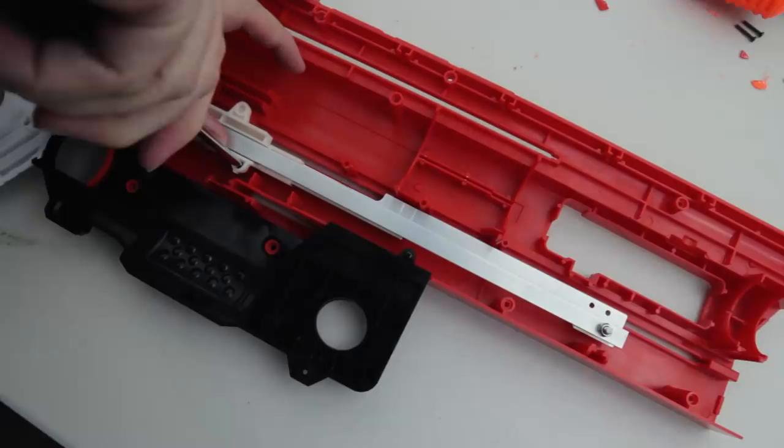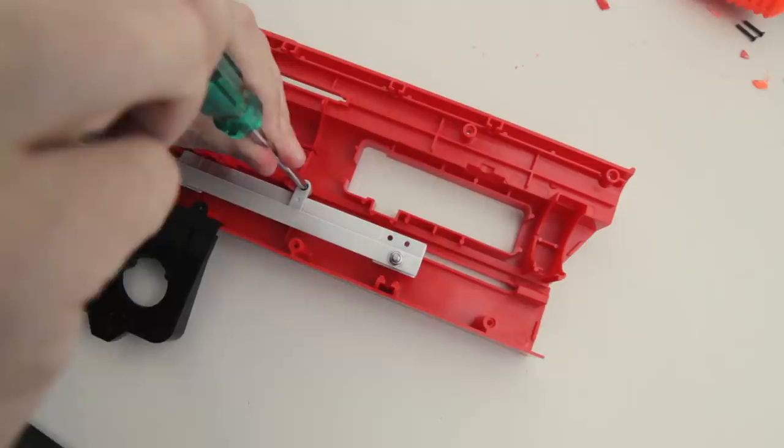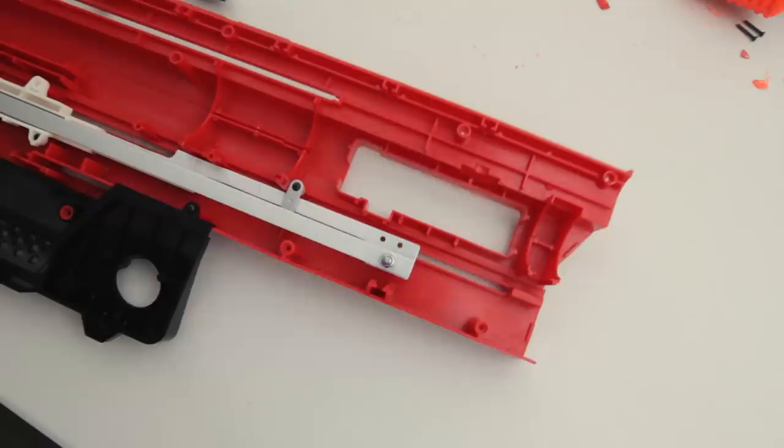And to make sure that the back lock nut actually fits into the bolt slot on the shell, make sure the hexagonal faces are in line with the slot. Finally, because the priming bar was in the way, I couldn't put both screws back into this little piece that acts as a support between the upper and lower halves of the shell, because there's a giant slot cut into it that weakens it. However, it still keys into the two screw ports, so I think it helps. Anyway, onto the pump grip.